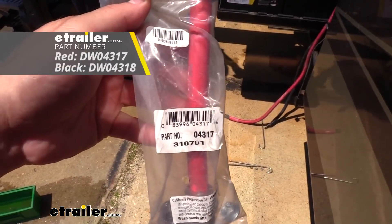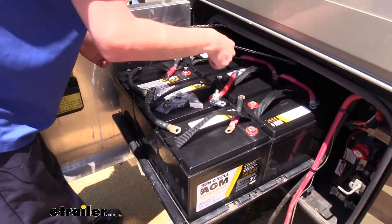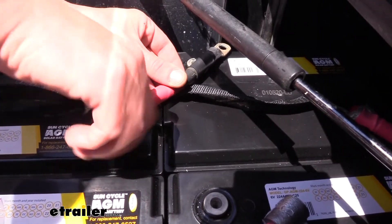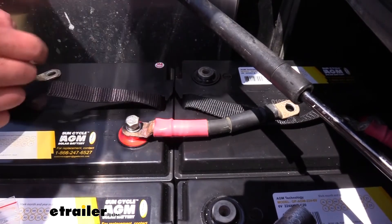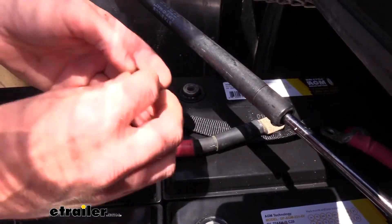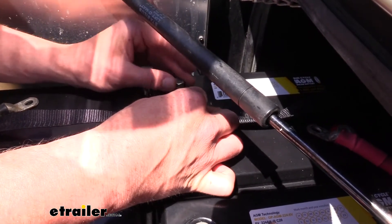We're going to start now — we've got our batteries set in place and the cables laid out where they go, just so we have an idea of where everything needs to be. We're going to start by hooking the batteries in series, making our three 12-volt banks. Your batteries do come with new hardware — you want to make sure you have the flat washer and the lock washer on there. We're just going to thread that onto one battery, then hook the other end — this is the positive on one battery — to the negative on the other battery. We'll get everything loosely set up first and tighten it all the way down at the very end.